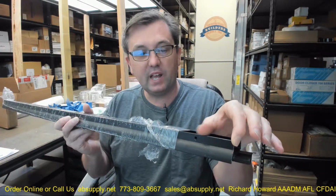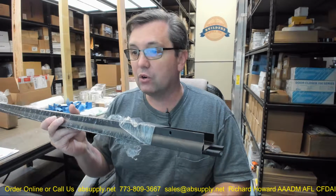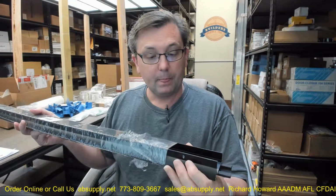because well, you've got this slotted hole that's here at a kind of standard distance from the edge. And if you were to cut that down to 32 inch, your next hole's all the way over here. You're going to be stuck drilling a new hole, and naturally drilling a slotted hole is difficult. You're going to want to be able to have slotted holes from the factory, if at all possible, because it will allow you to tailor the installation on the bottom of the door to account for a sill that's not level, or maybe a door and frame that are not plumb. Or if when you're pre-drilling the holes, that drill bit may have walked a little bit before it pierces into the wood, aluminum, stainless, bronze, steel, fiberglass, whatever you're installing it onto.